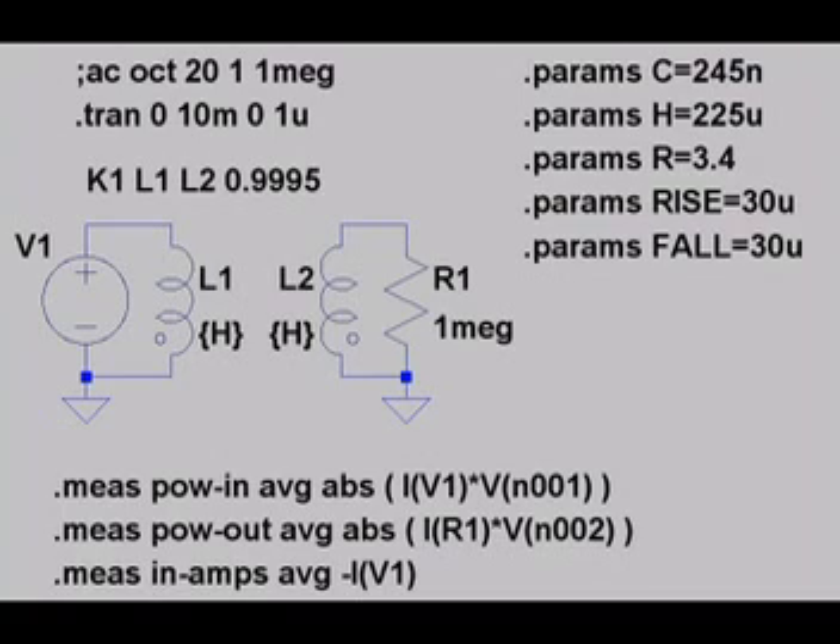When I put a sine wave input into one winding and ran the output of the other winding into an oscilloscope, a resonant peak at about 14 kHz was found. I modeled the electrical parameters I just gave you in SPICE, and found that this resonant peak matched very well with the SPICE model.